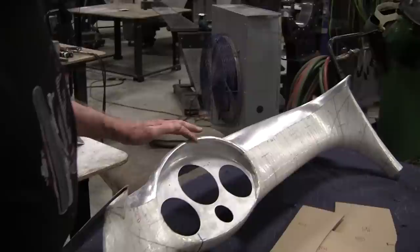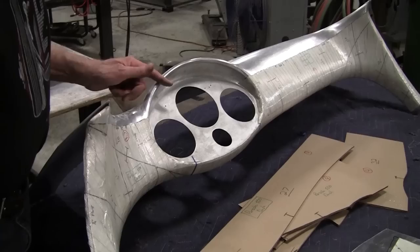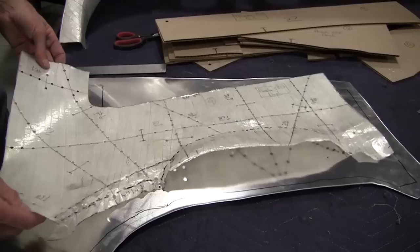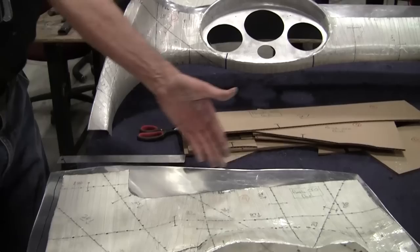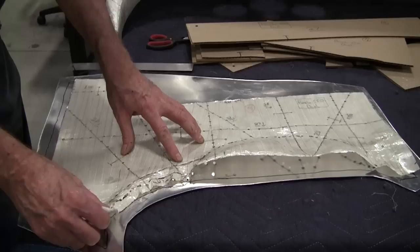On this edge you actually have a roll going this way and it's pretty straight here, so there's just a roll with no compound. The dash comes up and over, and we're going to break it and put a weld right there — we'll make this little underneath skirt as a separate piece. We'll probably make a little 3/8-inch steel hammer form, tune that up, and then weld it and it'll come out perfect. Mark made a paper pattern off this with the allowances we need. When working with a panel that has a cutout, generally don't make that cutout until you need it.